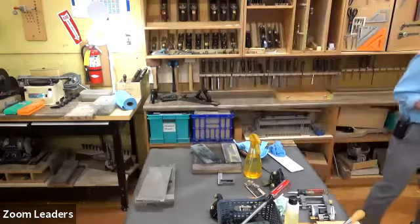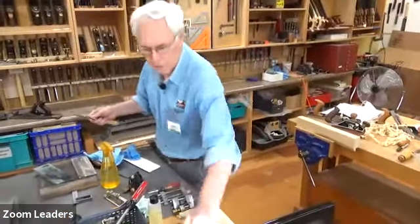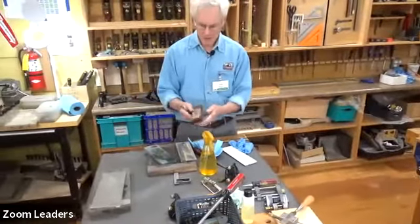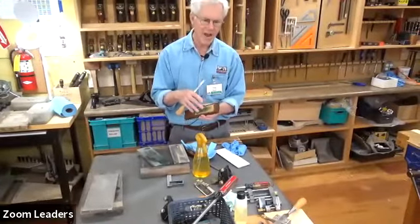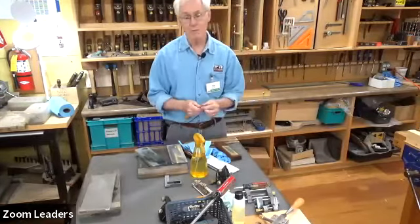Back to here. Back bevel, micro bevel, and then I just put stropping with a question mark on the latest update of that, which I don't think you have. This is a strop. Well, there we go. It uses an aluminum oxide in wax compound that you put on leather or something, and then people will strop it a few times, sometimes even both ways.